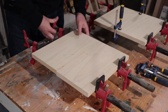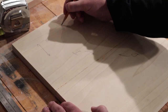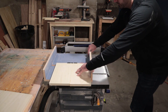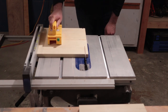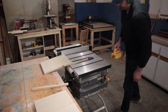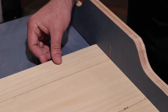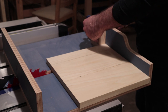The next day I'll remove the two sides from the clamps and cut them down to their final dimensions — right around a foot wide and ten inches tall. I'll use my crosscut sled to square up one side, which I'll reference against my fence to cut the pieces down to twelve inches. Then I'll work on cutting the height to ten inches. Looking back, I didn't do this right — I was trying to measure out five inches in either direction from the seam so the seam was in the middle. I should have lined up the material I was keeping against the stop block rather than the waste. Either way, it all worked out in the end.